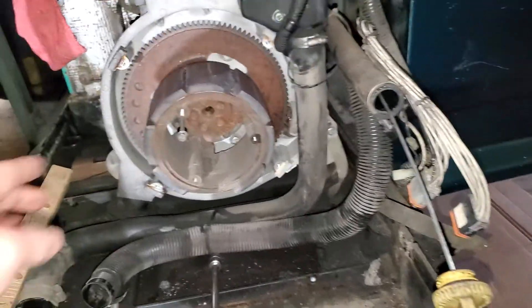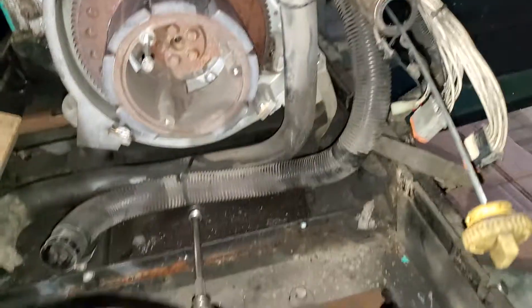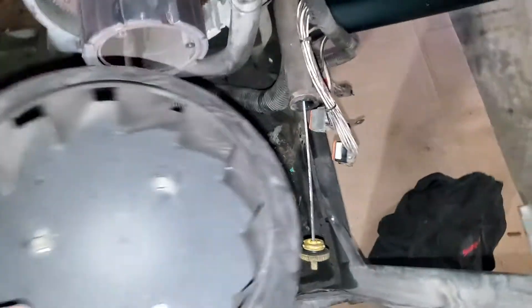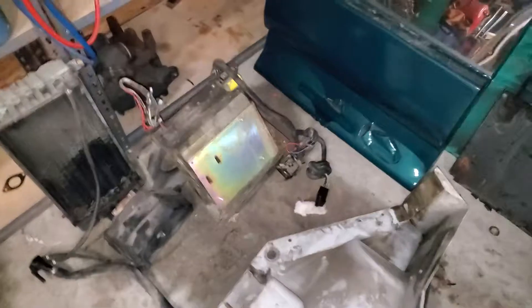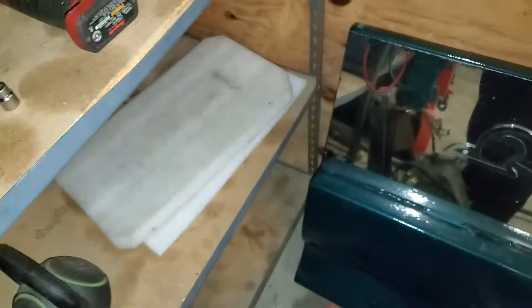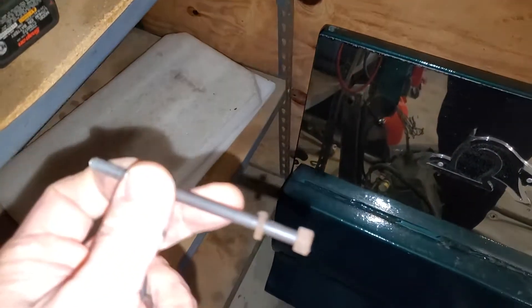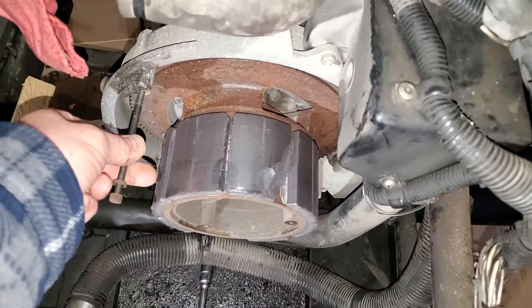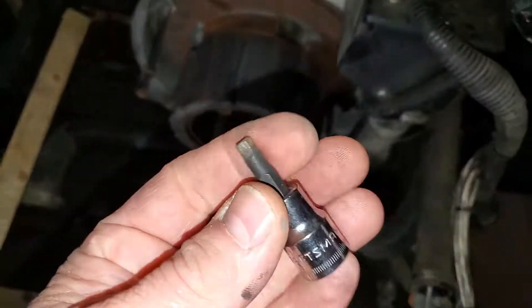The rotor has to come off in there. The three bolts that hold it are 10-millimeter hex. We already pulled the shroud off, the exhaust off, and the inverter/converter electronics assembly. There were a lot of T30s holding that on. Here's your Allen — that was five millimeter. That's the bolt that held the stator on, and there are four of them, so you need a five millimeter.